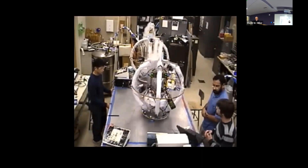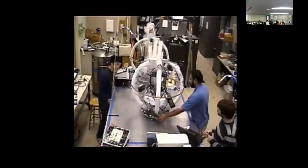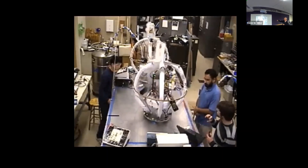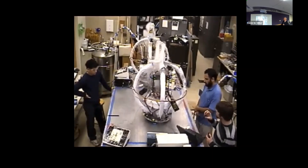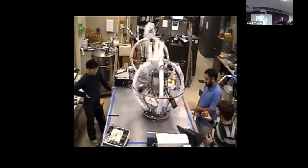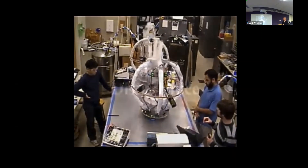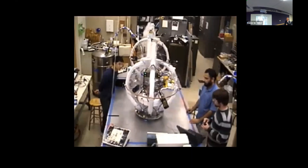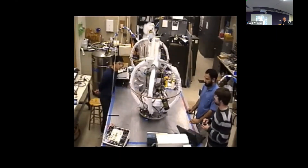With the improved test bed we implemented closed-loop control. The background vehicle is bolted down; the foreground vehicle floats and tries to hold position at a marked tape. When nudged forward, it puts current into the face-on coil to return, then reverses current to stop the separation rate. We demonstrated the shear mode using the reaction wheels much more effectively — there was some wobble from gain tuning, but it came back. The electromagnetics are on par with reaction wheels in terms of the torques they can generate.